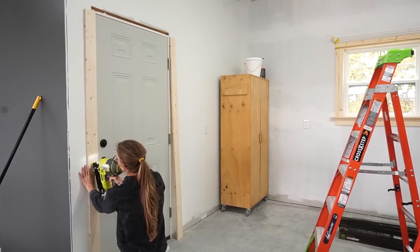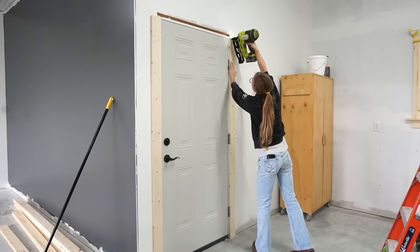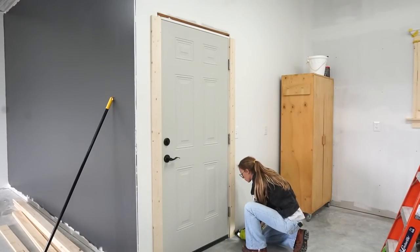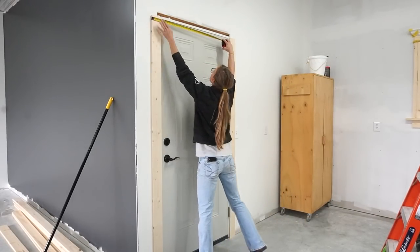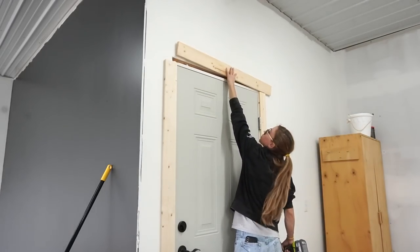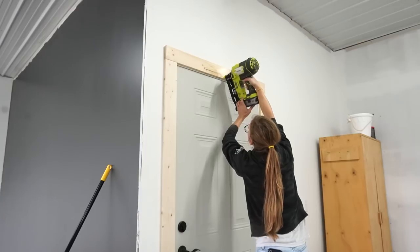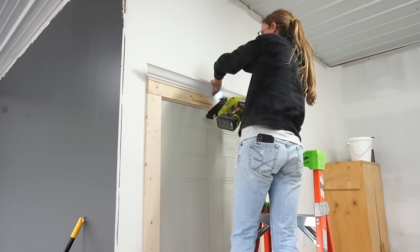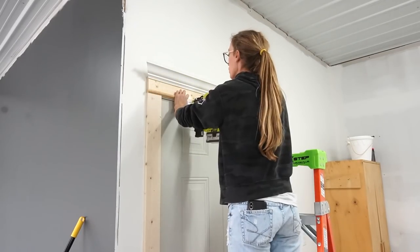While the glue dried, I moved on to trimming out my door. I trimmed doors the exact same way as windows — only there's just two sides, a top, and the molding. The inside frame is already there. So I measured from the floor up to the bottom of the top piece of the door frame, then added an eighth of an inch for a reveal. I installed two 1x4s this length on the sides, making sure to get nails secured into both the stud framing and the door framing. Then I measured and cut a 1x4 to run across the top and nailed it in place over the sides. I installed crown and half round molding exactly the same way as the window — basically, if you can do the window trim, the door trim is a breeze.